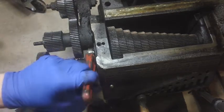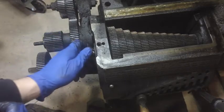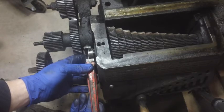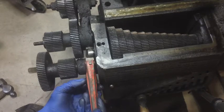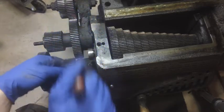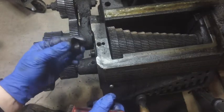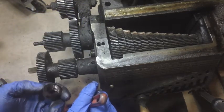I had an old monkey wrench around here somewhere that has flat jaws that are perfectly flat, no teeth on them, and that would be a perfect little tool for a job like this right now — another one of those antique tools that I don't really think about saving. Then you come to a job like this and think, ah, I remember that — no teeth on it, that would be perfect for this. I could probably grip it just enough to still turn it but wouldn't have to worry that if it slipped it made a nasty mess out of the outside of this. If this was really tight I wouldn't use this pipe wrench because the teeth are going to mar this and make it really look like a hack mechanic. But I've actually got that pretty loose now. Easy peasy. That worked out well.